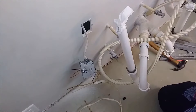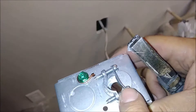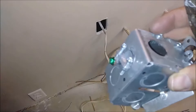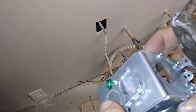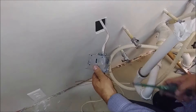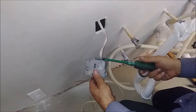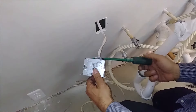I want to add that I have to put this conduit in the back of the box — and remove this piece of metal that I had in the wrong place before. The box could not go in because of that, so you have to put the conduit in the back of the box. It will always be easier for you. I have to repeat it and put it on the back of the box. Learn from my mistakes: if you're using this type of box, put the conduit in the back to avoid a lot of problems.